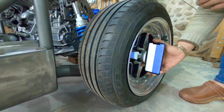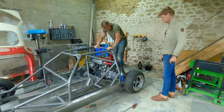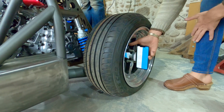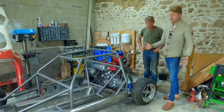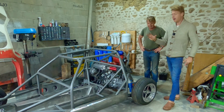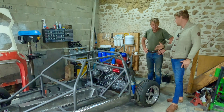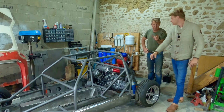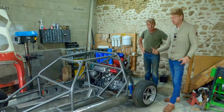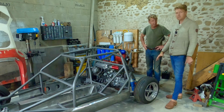We really must get some new jacks. Static camber is 0. Move it again. 0.8. That sorts a lot of things out. Yeah. We haven't done a proper alignment yet, obviously, but we've done a rough alignment previously, and we were okay, but we weren't where we thought we'd be. No. And we thought we'd have to loosen and realign the front mount. Yeah, because they're actually on slots, and they give us even extra adjustment on top. But this is actually where we should have been the entire time. Yeah. Automatically. So that just shows where we'd gone wrong.